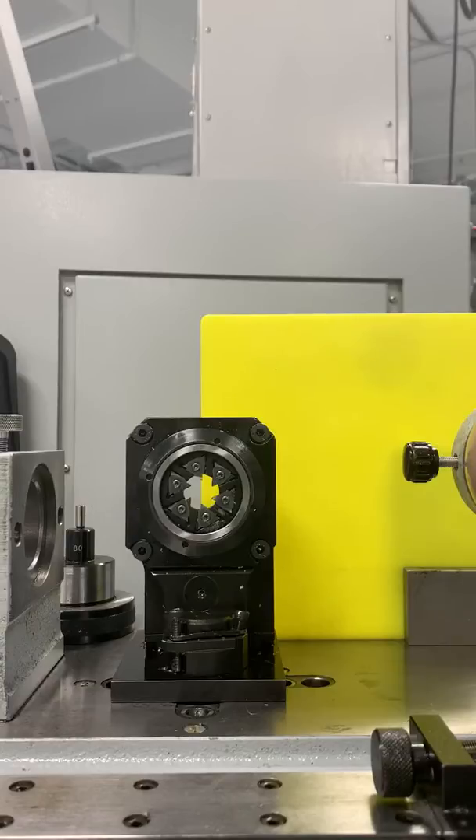This is a WTO whirler. I got the little yellow box behind it to show that that would be the center line of the whirler in the machine. It would actually be tipped horizontally, but this is a good visual. Your cutting surface will be on this side of the ring all the time, and the material would pass through the very center of the whirler and then cut right here. So you want the whirler to be on center.